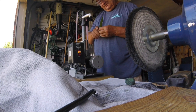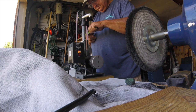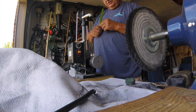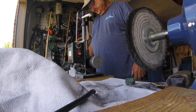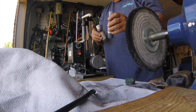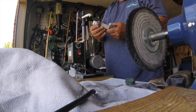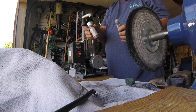But sometimes I do follow up on leather. Theoretically I'm finished now. I'm able to put Ken Schwartz's diamond paste on here — the diamond paste is really nice. It comes in emulsion like this, you shake it up, it's water-based, and you just spread it on here with your finger. This is a .05 cubic boron nitride, 4 micron emulsion. I've also got it at 8 and at 2 micron, it's just not handy where I can show it to you.